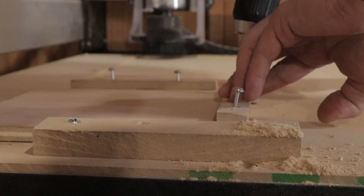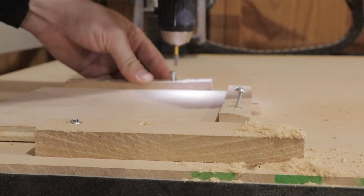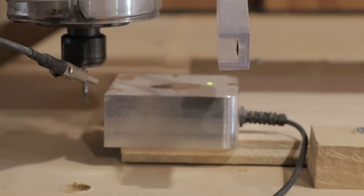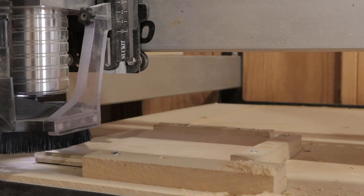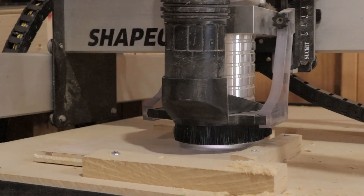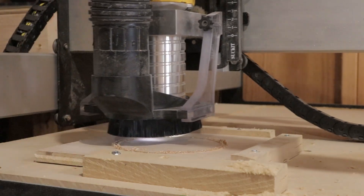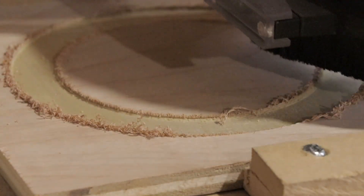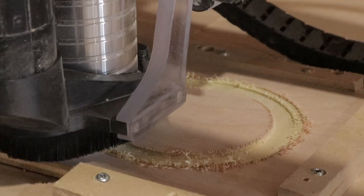You can cut this out however you want — you don't need to flush mount this. I decided I'm going to go all out for you guys and use the CNC, so I CNC cut everything out. A four and three-quarter inch hole for the passive radiators — you'll need two of those because you're using two passive radiators — and then whatever you decide to use for the subwoofer. If you don't have access to a CNC, you could literally just use a jigsaw and skip flush mounting and just mount it on the outside. You really don't need a lot of tools for this — you just need to make an 8-inch by 8-inch cube and make any hole as long as the subwoofer fits in there.